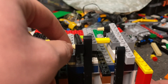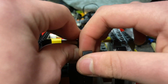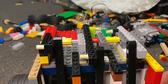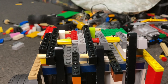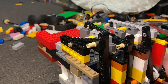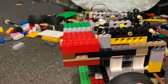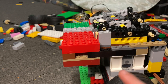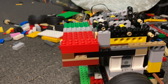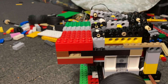The reason I use these three-long connector pieces for the valves is so I can easily detach and reattach them when necessary for cylinder maintenance. Let me take off the cylinder head real quick — it's actually a lot simpler than you might think, which was surprising. When it turns, it pushes the rockers which push the valves down. When it pulls the valve up, it opens the air chamber into the cylinder. It runs in a counterclockwise direction looking at the flywheel, and I use smooth pieces to make sure the valve always moves as smoothly as possible.